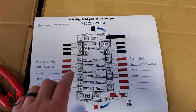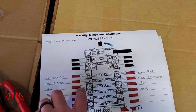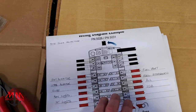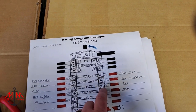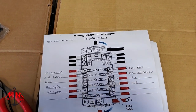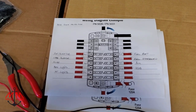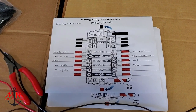We labeled each circuit: port aerator is brown wire, starboard aerator is brown wire, bilge aerator is brown wire - we'll add tape on either end to differentiate them, so brown-and-white, brown-and-yellow, and solid brown. Then gray for nav lights, blue for interior lights, pink for fuel (pink-and-white for one side, solid pink for the other), yellow for an auxiliary switch, and orange for a USB plug. That leaves three empty slots, which should be more than enough. We'll also run wire to the front of the boat to power a graph and maybe an auxiliary switch up there. We'll go pick up supplies and get to it tomorrow.